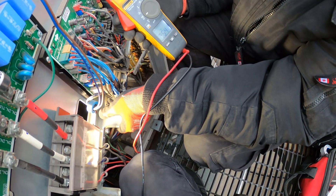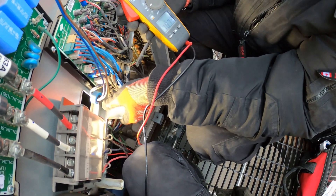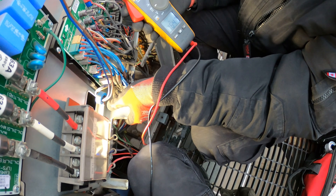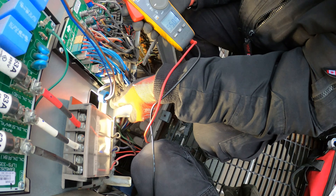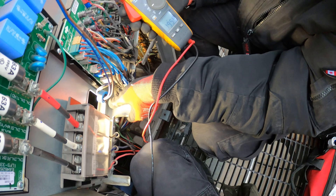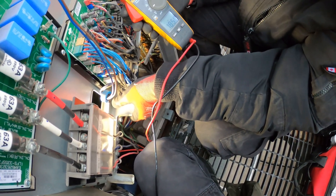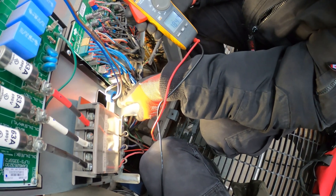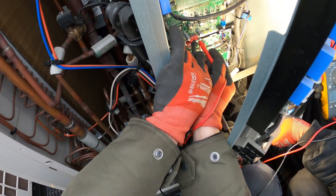All right, we're reading — let's see if it's above 1 kilo-ohm. Let's see where that balance is: we got 1,000... let's make sure we got a good reading. If it goes below that 1,000 reading, it's bad. We do have above 1 kilo-ohm — this is 1,846 ohms. Let's check the next pin.